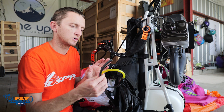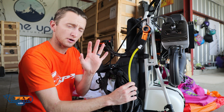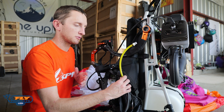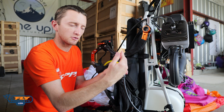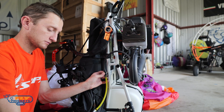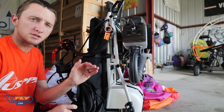So this is how we install the actual injector itself. We have the injector here, our rivet nut, and our tubing. This is where the one-way valve goes and the connector from your smoke system. This will get mounted however you see fit — this is just how I like to do it so it's easy to access without taking off the motor. Everything can be done while you're in the paramotor system itself. Remember this is a one-way valve plus you have your check valve, so backflow from the paramotor isn't going to go through the tube. Make sure the black tube is going up towards the exhaust and wherever you're putting your injector.